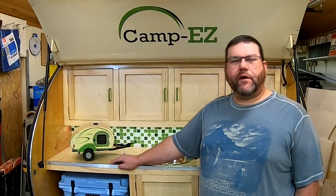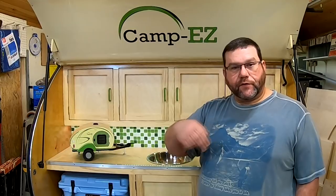Welcome back everyone. This is going to be the last build video in the door build series. So far, we cut the door core out, sheeted it with plywood on the inside and outside, bent the exterior trim for the door, and put hinges on it before we did a trial fit in the last video to make sure that it would open and close okay. Today, we need to disassemble the door so that we can put the aluminum sheeting on the outside and put Trim Pro caulk around the trim that goes on the exterior of the door — that will button it all back up before we put the window in. We may come back and do a comprehensive video that covers everything nose to tail on the door build, just covering the highlights. But let's get started on this last one.